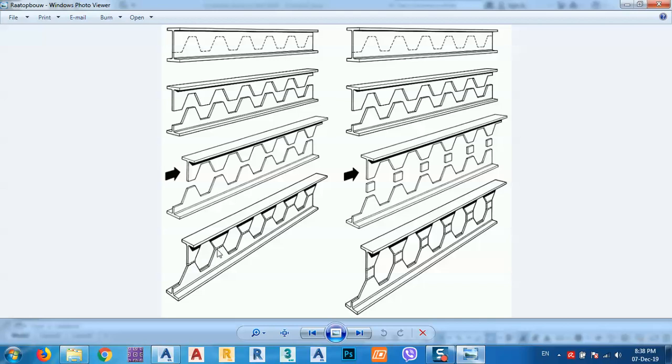As you see, this beam is cut out like this, then shifted. You will cut the beam like this, take it out, and shift one piece by one. This distance should be the same as that distance, so this one sits on top of the other. After that, we weld this and we get a higher beam. So the total height is H plus A.